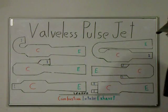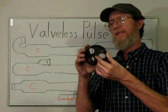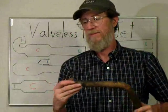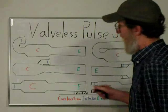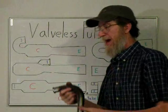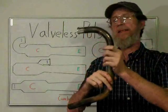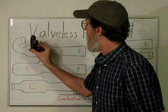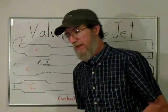Another interesting thing that came out of the muffler was this piece here — it's got three holes, and the motorcycle tube just slips right in. This would be too small for any of the curved designs, but on this one here, I could cut and make the curves double back on themselves by cutting one curve and welding it into the other. I could have three intakes that would fit into this, and this would weld onto the backing. This part is all stainless, and this other part isn't stainless, but it can be changed later.